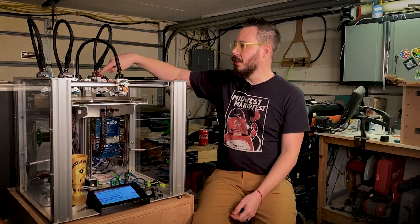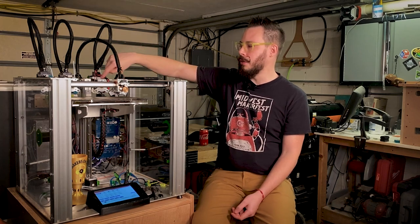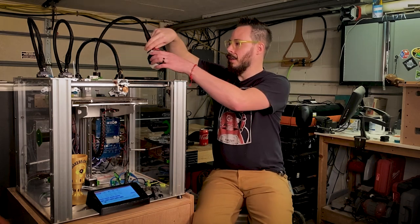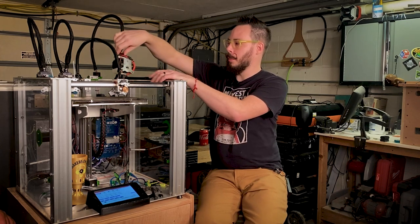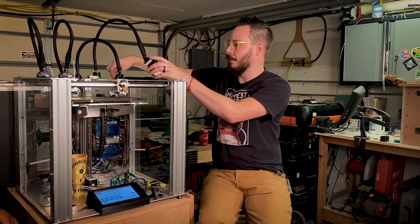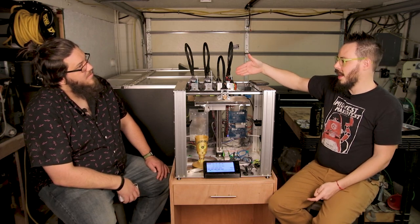The hard part is your tool dock, the key position can never change, because this can't go up and down. So when a dock needs to get taller or shorter, you have to change where the forks land. For these two forks, I had to gain some more Z, so I lifted them up with printed lift and extend pieces that change where it mounts. Normally it would mount right to the plate. If you extend the tool out and the crossbar is going to hit, you have to extend them all out, so it has to be a holistic plan of attack. I'd be curious to see somebody do a direct drive BMG just for morbid curiosity, but I haven't seen anybody do it yet. Fair enough.